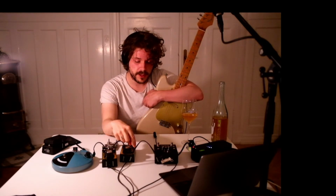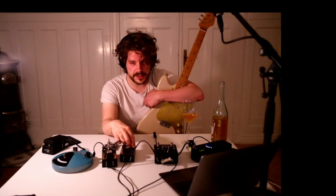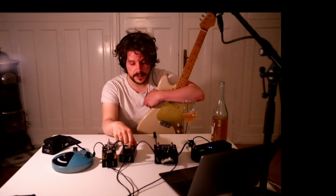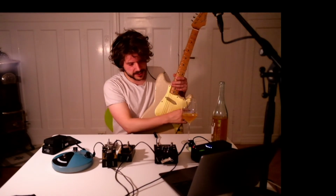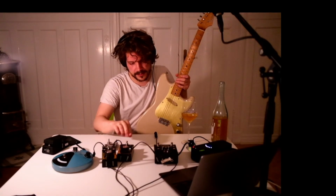So at zero, I think you have, in this one, I think I landed on a 1 nanofarad. I may have landed on 10 nanofarad. I'm not quite sure. 5 nanofarad is what's in a treble booster. That's why it's a treble booster. But the big one is 10 microfarad. So that's like a 1,000 times bigger. And so you can go from what is essentially entirely too much with it at full tilt.